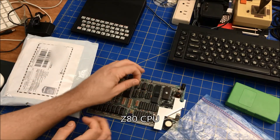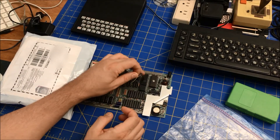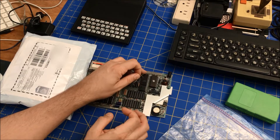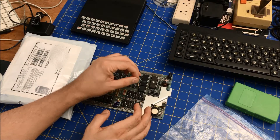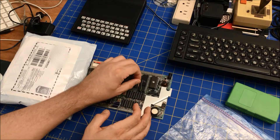I'm not even going to put this back on today because this is a bad chip. I'm just going to see if I can put another Z80 chip in from here and replace that. I don't know what this component is supposed to do, but my other Spectrum doesn't have it.